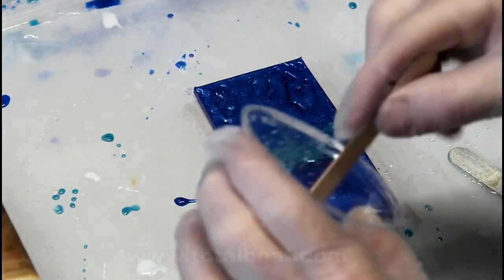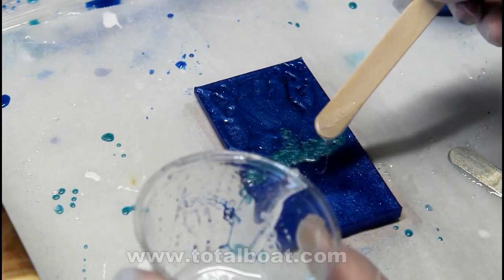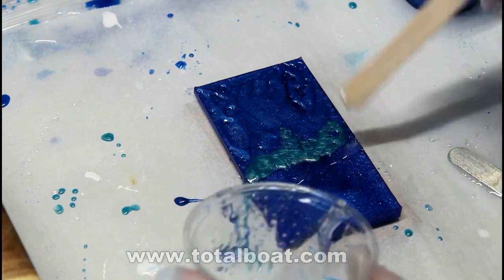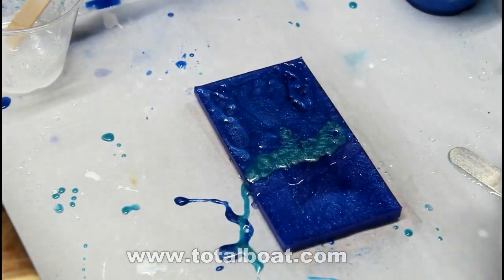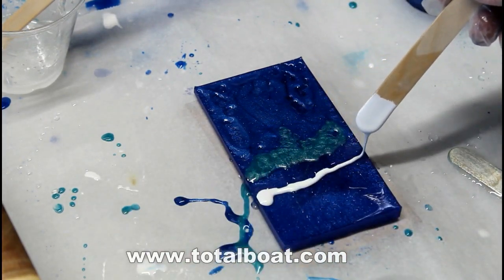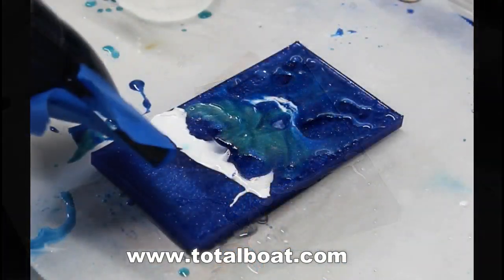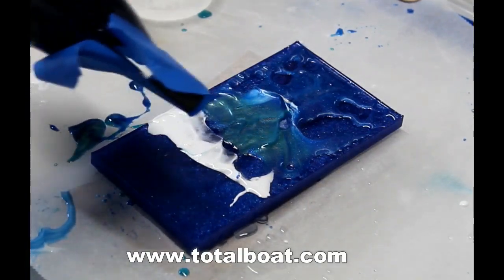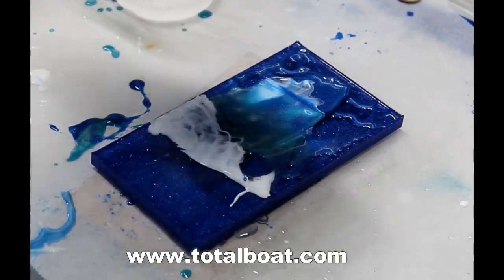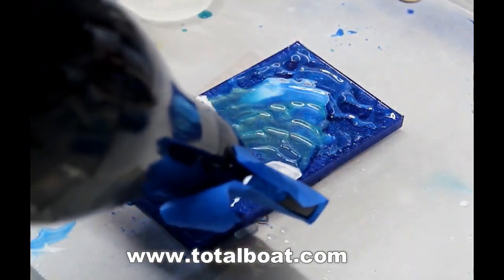What I finally figured out was to cast solid blue slugs in my mold and use those as the base of the waves. Then I added some color — light blue, turquoise green, a little bit of clear, and behind the clear, white — with the thought that the white is going to flow into the clear to create those waves. Just like on the cutting board, I used a hair dryer on cool just to move that white and get that resin to start to flow into the shape, especially shaping the white the way I desired.